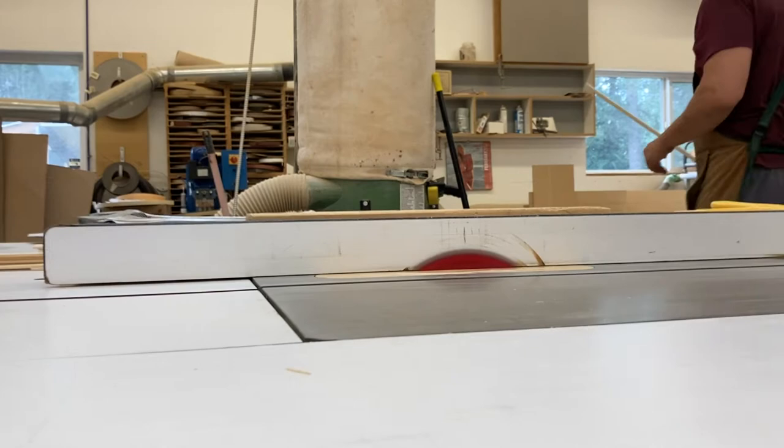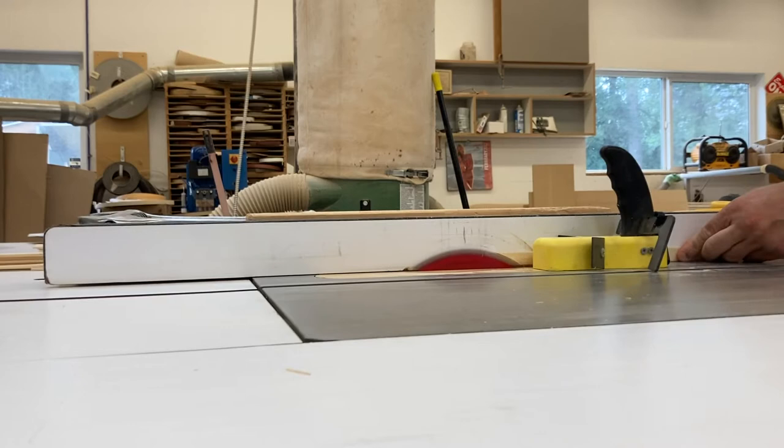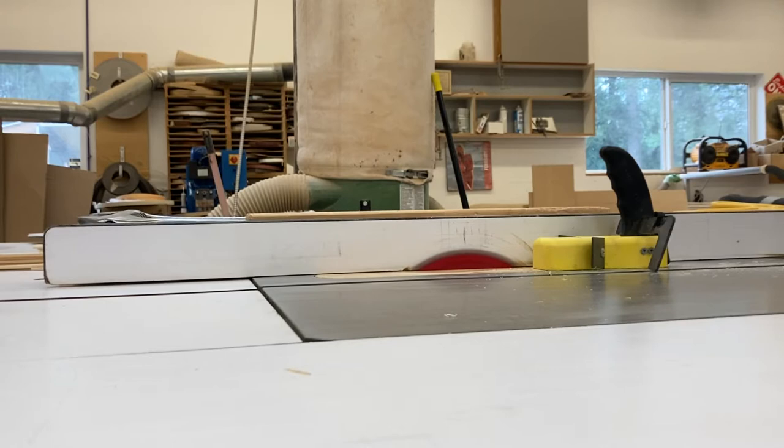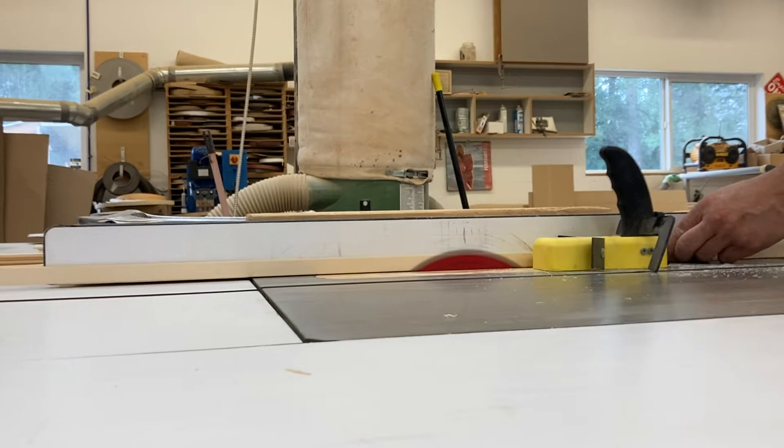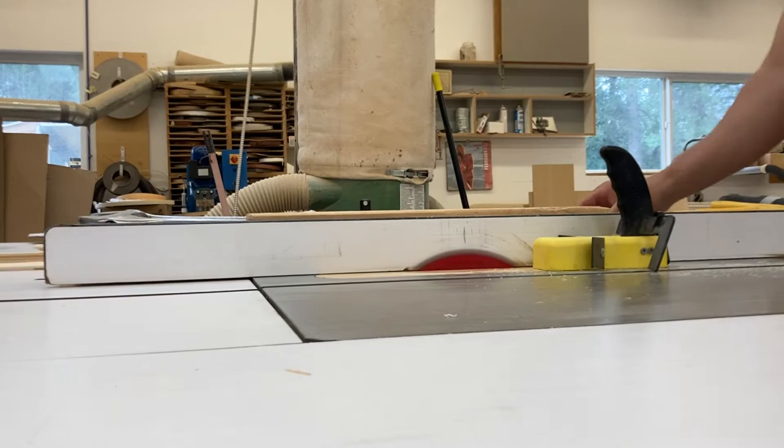You see me here about to make a cut, and I decide to grab a magnetic feather board — keep it over in the dust collector there. That will keep my pieces tight against the fence. I'm just pushing them in until they're a little over halfway, then carefully lifting them straight up, flipping them over end for end with the same side against the fence, and pushing it through to finish the cut. That way I never have to pass over the blade, even with a push stick, and my hands are pretty much always behind that magnetic feather board. For furring strips, the results were satisfactory.